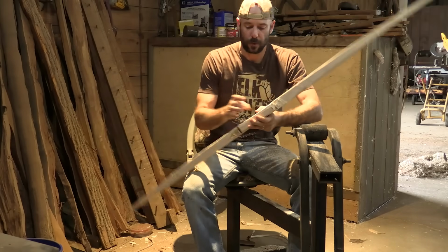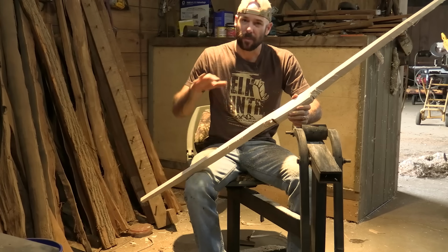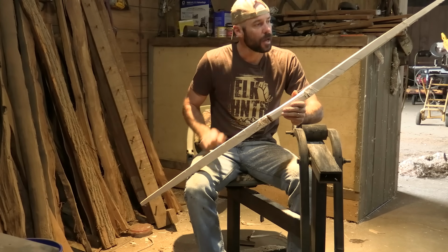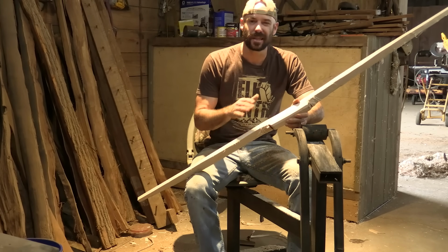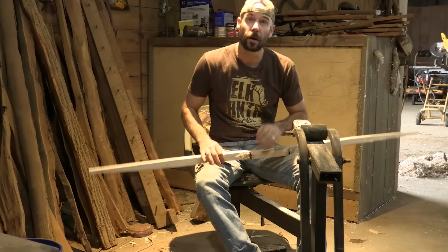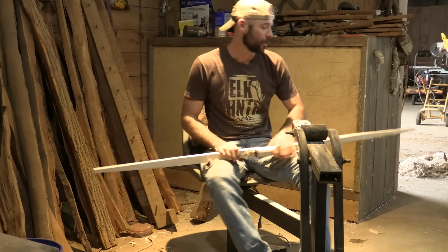So now what we're gonna do is we're gonna draw the depth of our handle, we're gonna draw the fades on here, and we're gonna draw our approximate limb thickness. On this, I'm probably gonna start about a 1/2 inch. A 1/2 inch deep, that's gonna give us some room for error. The limbs are actually gonna end up probably less than 3/8. So if we go with 1/2 inch, that's gonna give us an 1/8 inch to play with.